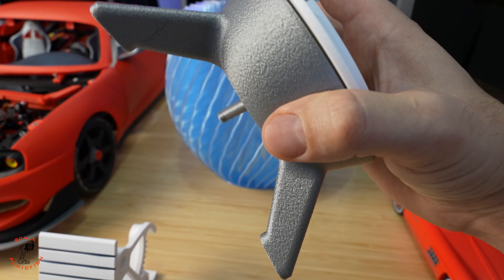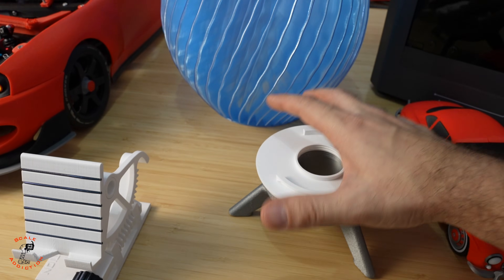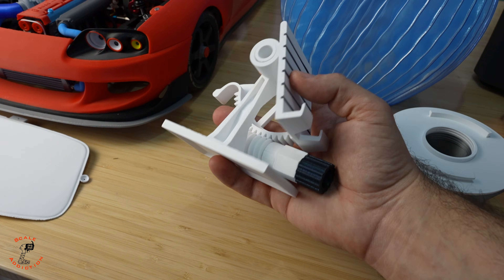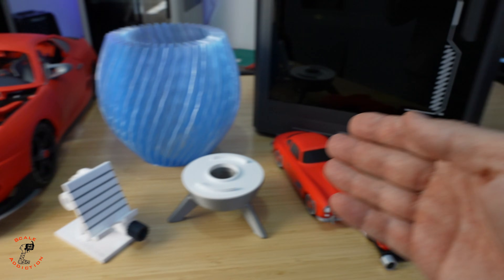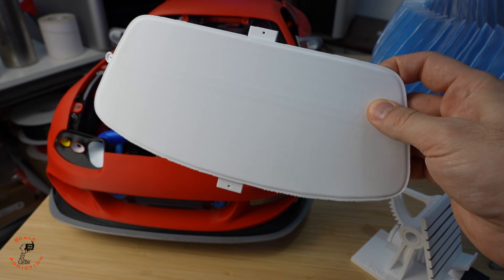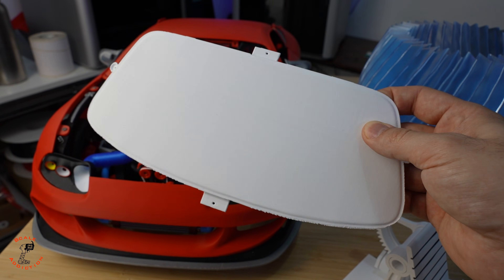The lamp shade is clear PETG — durable and transparent. The base is silk PLA with fuzzy skin and it came out really good. The legs have small pieces printed with TPU so it doesn't make any sound on the table. Next is a normal PLA phone holder — it's print-in-place and I had no problem with tolerance. I also test-printed the windshield for my project to check measurements, and after that we'll print it in clear resin in upcoming videos.